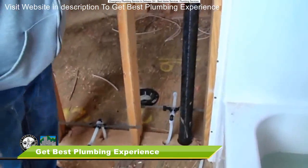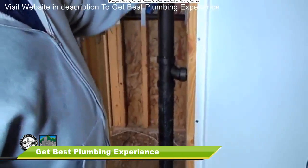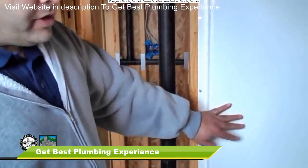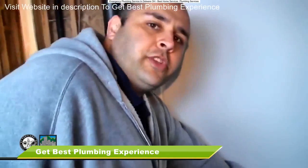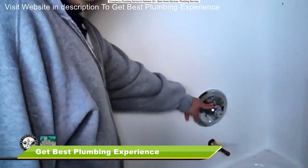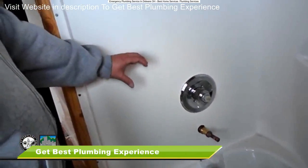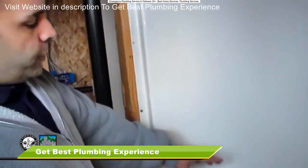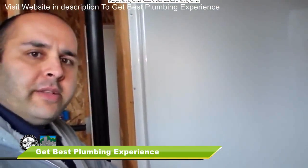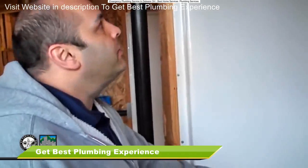Then we're sharing this common vent here with the tub again. And then as we look at this tub, we're going to make sure that it is the proper size. Make sure that it has a pressure balance, temperature control valve that has its own setting, so we can maintain not more than 120 degrees on this valve. And if you flush the toilet, then the pressure balancing valve makes sure that it doesn't create too much hot and not enough cold, so somebody gets scalded. So that's our scald protection.